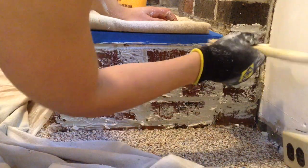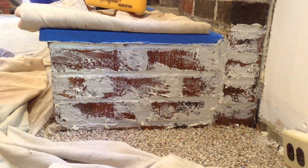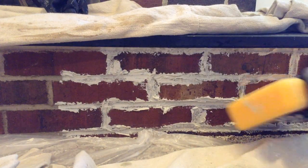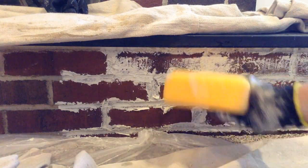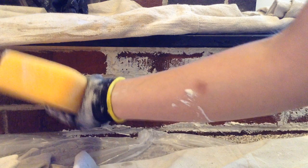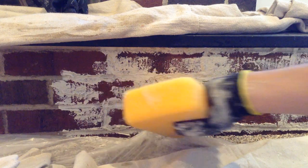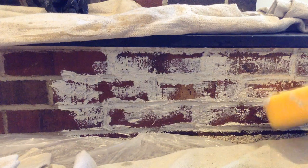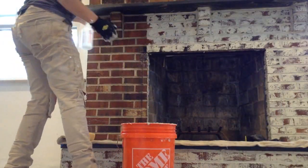Compared to what it looks like now, I did end up putting a bit more material on there, especially on the front of the fireplace where all the different colors were. I wanted to even out the tones. I then switched to a sponge — another tool people use for this. Same process: putting thinset into all the joints, but then also spreading the extra material from the sponge quite gingerly, keeping it textured so there are high spots and low spots, making it look more like a hand-done plaster application.